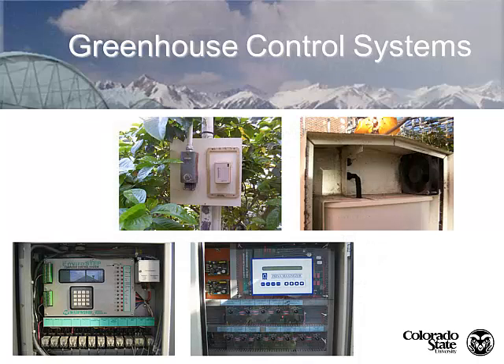This picture shows a simple setup — a 24-volt bimetallic thermostat for the heating units, and a heavier-duty unit for the fans. Since it's got steel conduit, that's likely live voltage running through it — not something I would design. I would prefer that everybody uses 24-volt current when inside the greenhouse. It's much safer.